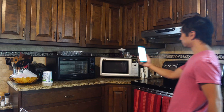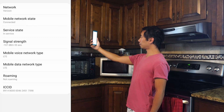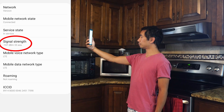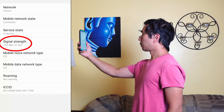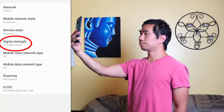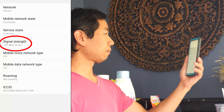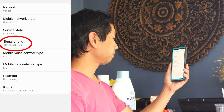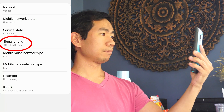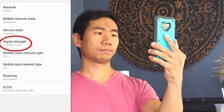For setup, you'll first need to determine where the weakest signal in your house is. To do this, you can use an app on your smartphone or simply view the signal strength in numbers in your cell phone's settings. Here you can see the signal inside my home is generally around negative 115 to negative 107 dBm. That's pretty low, considering negative 120 is basically an unusable signal, while numbers closer to zero are better signals. That explains why I'm always having dropped calls and sometimes call audio is garbled.